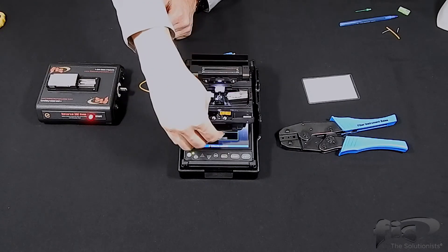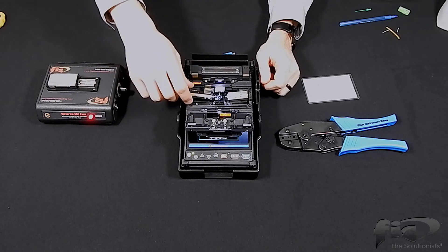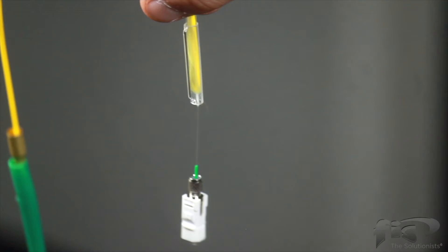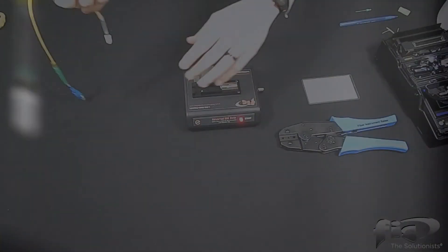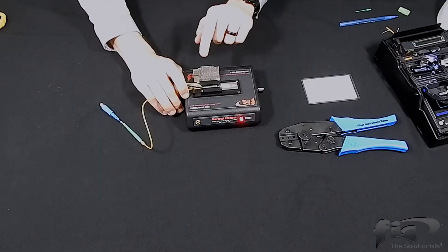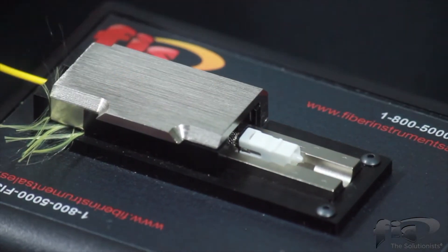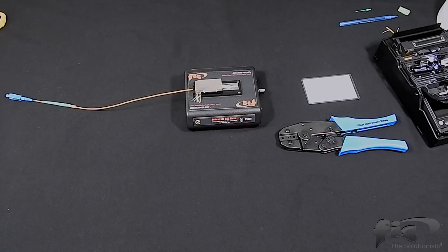Open the windscreen and carefully remove the fiber by gently picking up the cable end, allowing the connector to hang freely. Slide the heat shrink tube over the splice and set into the oven. Close the oven's lid and press the start button. The red light will first blink slowly as the unit melts the shrink tube over the splice, then speed up as the cycle finishes.